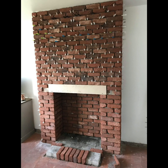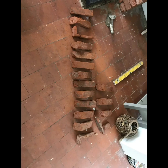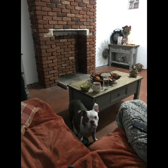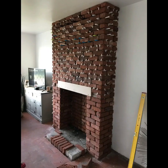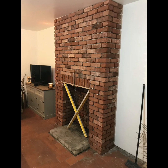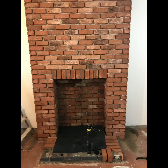You need to buy the spacers separately, and you can buy a pre-mix mortar from them but I didn't. I used a three-in-one mix and the finish I got — I basically just used a wire brush, went over it with my finger after, smoothed it out and it finished up lovely. It was a bit of a pain using these spacers because obviously the bricks aren't true, so when you're trying to space them properly you have to space them on different points on the brick to bring everything round right — right pain in the arse.